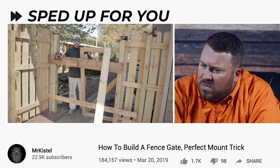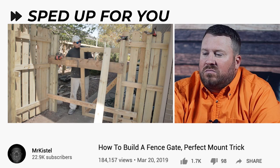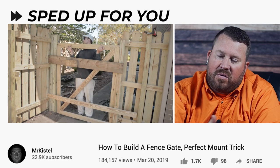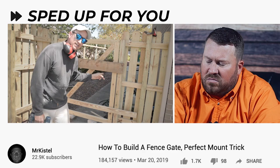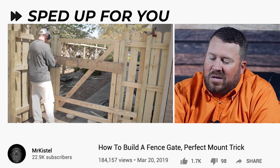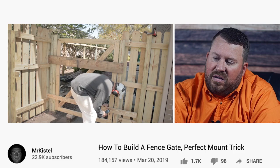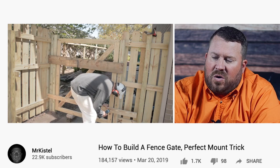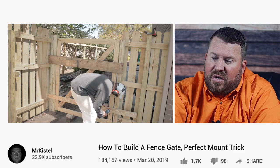This step is where he's taking a not-so-traditional approach. What he did is tack up scrap pieces of board and temporarily screw the door frame off to them — just an easier way to get it in place. Then he can go ahead and deck it out, put the hinges on, and when done just take the braces off. That's a good idea. He's putting a lot of holes in the gate — I would be curious to see if he fills them when he's done. That's probably some feedback we would get from customers.